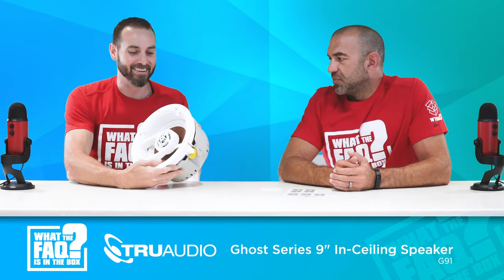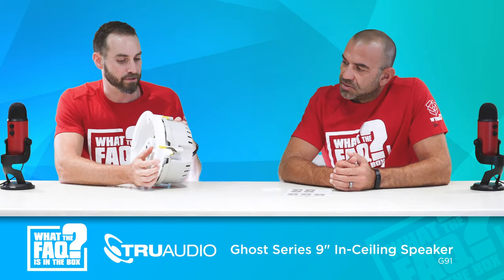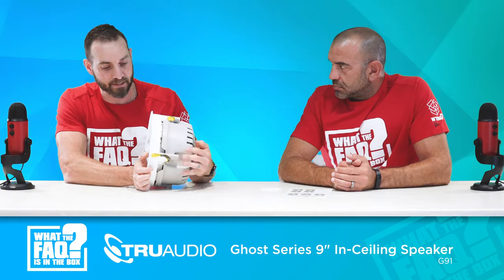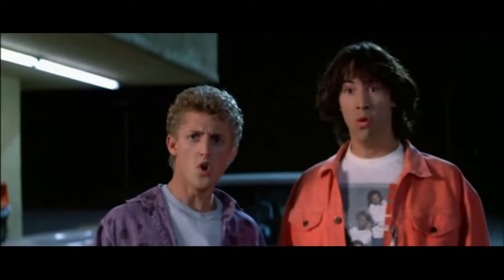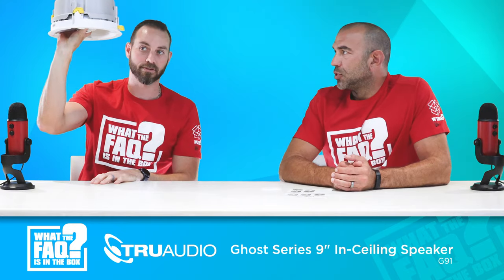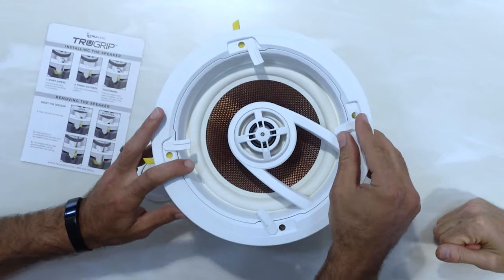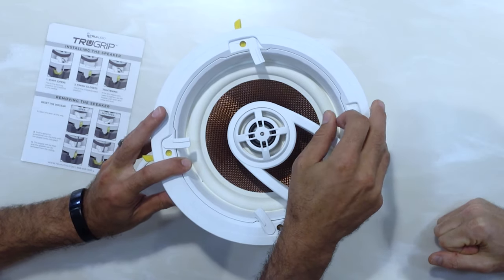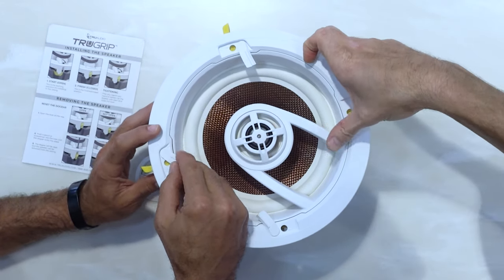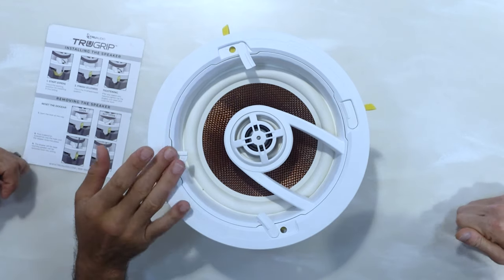You've got the true grip, which Drew is demonstrating right now. As you guys can tell, there are these little dog ears here, and as you flip them they quickly snap into place so you don't have to screw them into the ceiling — it holds very snug. You can very easily set those and they just click in real easy. You would just hold it up and snap each piece into place to attach it to the drywall. If you need to tighten it further, there's a screw, and it actually has a ratchet motion at the very end — so it's not only spring-loaded, it can also ratchet and tighten even further.